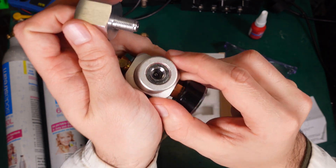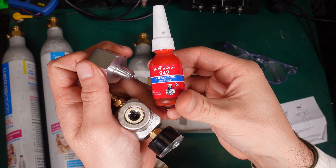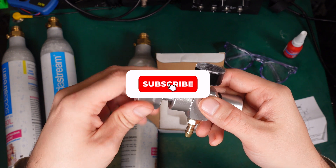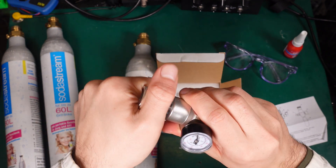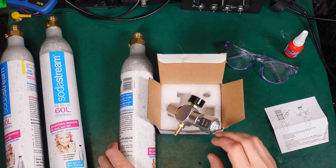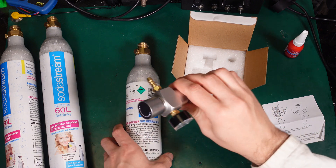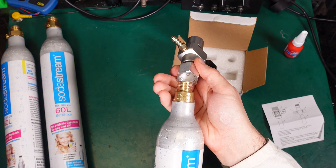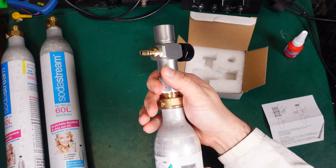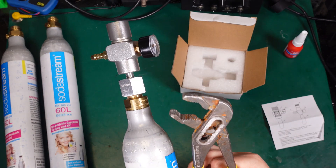We are going to put it together. This part does not need a lot of force because on the back you've got a rubber seal. I would advise adding Loctite just to prevent the thread from undoing by accident, but just for the sake of this video I'm going to skip that. Hand tight is going to be more than enough because of the seal. Now I'm going to put on my safety glasses and we are going to screw the regulator on top of the bottle — we are going to see and hear some gas release but it is 100% okay, we just have to do it quickly. Just like that. Now we can tighten it a little bit — just like that — and we are ready to go.